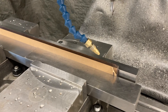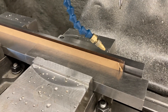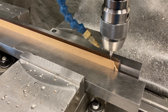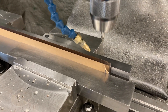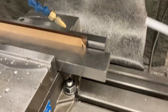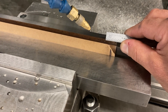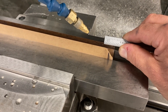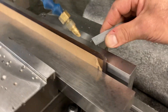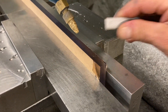So when I program, the first hole is 750 thousandths from the edge. I'll spot the first hole — I did one already so I know we're good. I spot the first hole and I take my Brown and Sharpe scale, bring it over, and scale out that first one. It's supposed to be 750 from the edge — yeah, it certainly looks like 750. Am I 188 from the edge? Yeah, about 188 from the edge. Certainly looks that way.